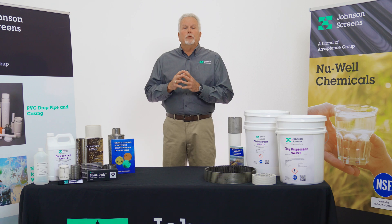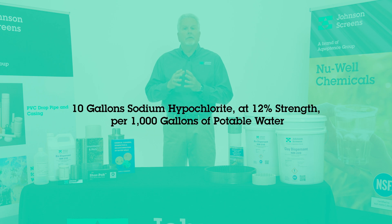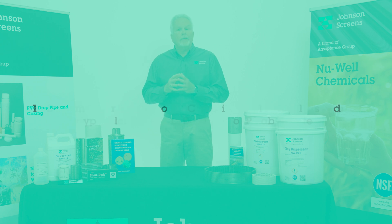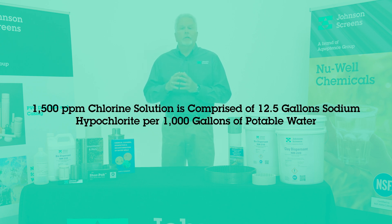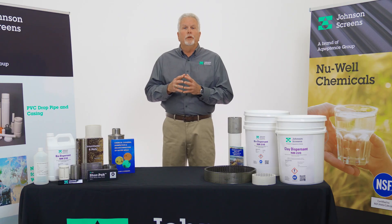Prepare the chlorine solution at the surface. A 1,200 ppm chlorine solution is comprised of 10 gallons of sodium hypochlorite at 12% strength per 1,000 gallons of potable water, and a 1,500 ppm chlorine solution is comprised of 12.5 gallons of sodium hypochlorite per 1,000 gallons of potable water. Place the chlorine solution evenly across the screen interval of the well and work thoroughly into the screen and filter pad. Only after 12 to 24 hours of soaking and periodic agitation should the chlorine solution be circulated out of the well, and all of this prior to the introduction of the Newwell 220.